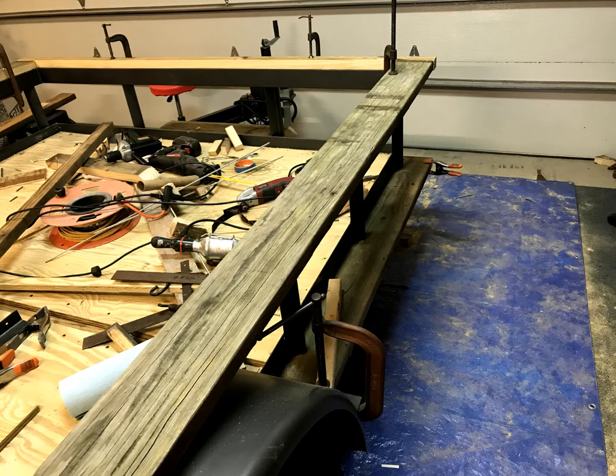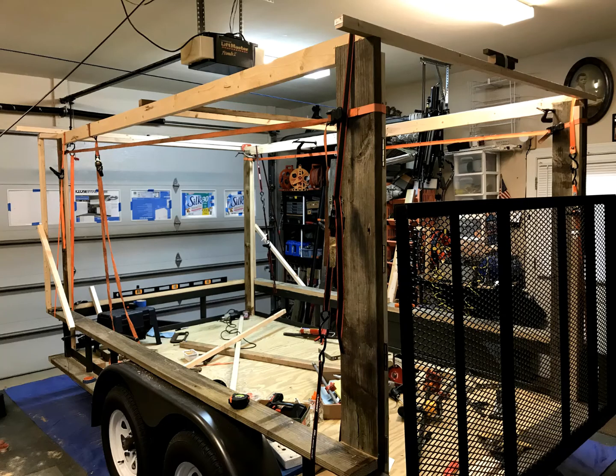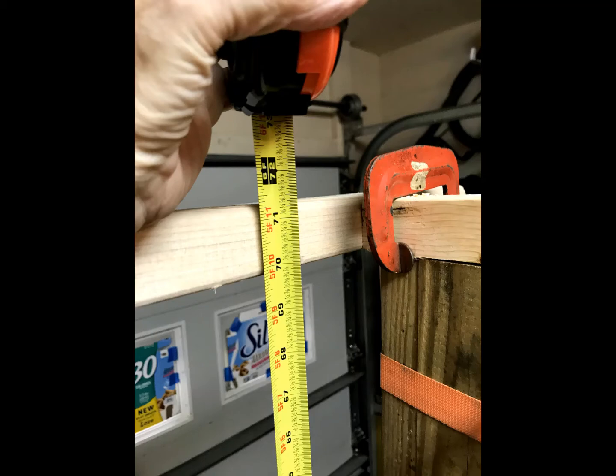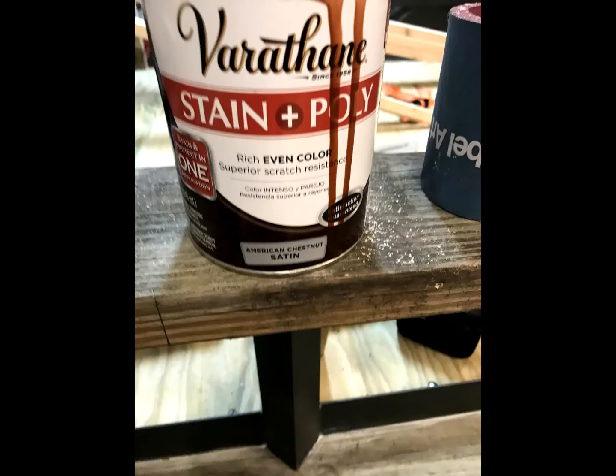I did this by adding a top 2x8 all along the edge rail. The space underneath the rail would become storage from the inside. Notice I had to pay close attention to the overall height, considering I had to add ceiling, paneling, insulation, and roofing material. I also learned how to use a pocket hole jig. That's my newest favorite tool to add structural integrity to the 2x2 joined structural members. The roof was framed with 2x2-inch lumber on 12-inch centers. I pre-stained the ceiling panels with pre-mixed polystain.